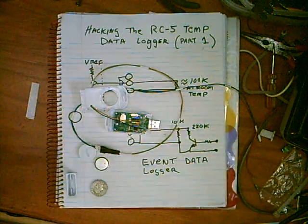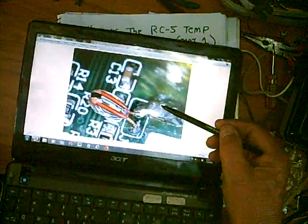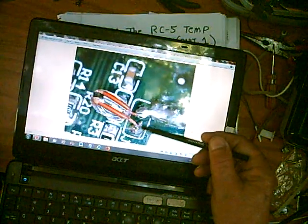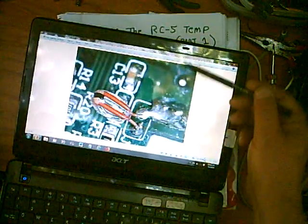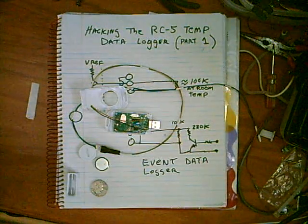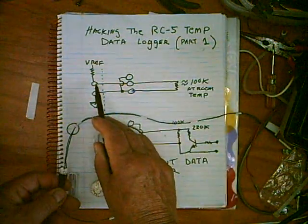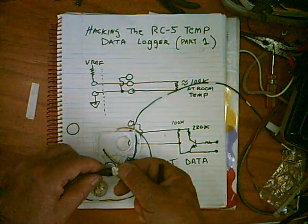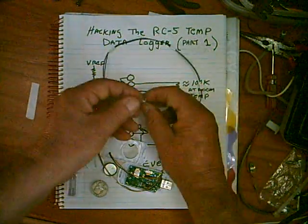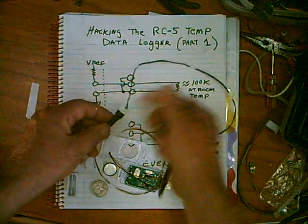The little temperature sensor is right down here. The temperature sensor is here, and this is the USB connector. This is delicate work, but you can get this out. I just attach a wire here, and on the other side of the USB connector I connect onto the frame, so I've got two wires coming out. I use a little three-pin connector — the center pin is the sense pin. If you're using just a temperature sensor, you can put this in any way you want as long as you hit two pins. This is a temperature sensor right here — it comes down to this little glass bead. Heat shrink it, put some hot glue in there to keep everything. I can pull this apart and put it back together.